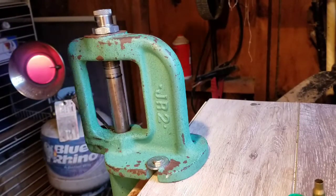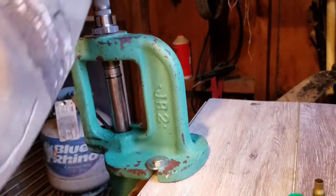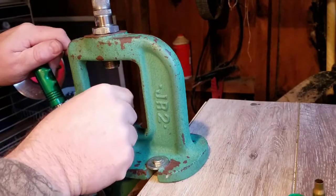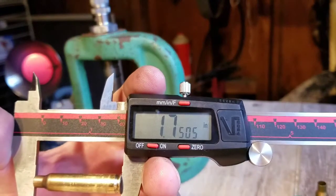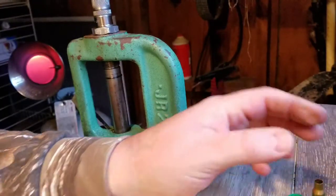Then you insert the Quick Trim and I'll try this without the other doodads on it. Usually it's spring loaded, but of course it's not spring loaded now because the blades are out, so it just sits all the way down. You're supposed to just turn this and it cuts. The manual says you have to turn it at least five times to get the cutting. So it did trim it — it just needs to be chamfered and deburred now. We are now at 1.750, 1.7505. So it does trim — there's nothing wrong with that.